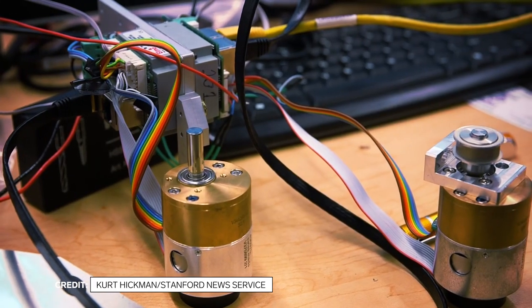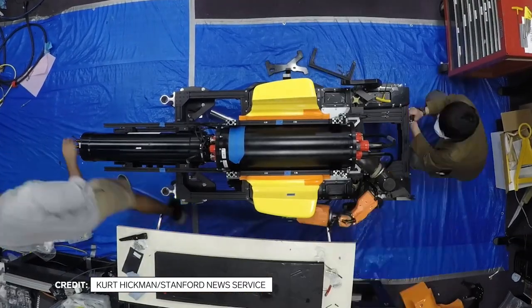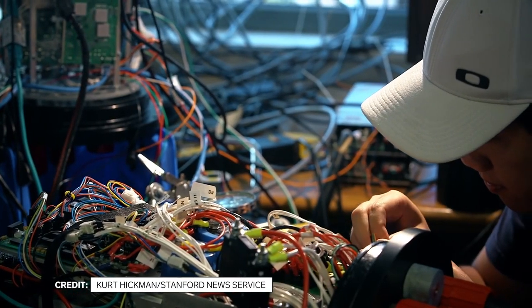A delay from September to February meant the ROV sat idle for months — Ocean 1K didn't like it at all. One arm was complaining, and to fix the connector you had to disassemble the whole robot because it's inside the shoulder. Underwater design hides a lot of things inside cylinders through connectors — it's very dense inside and covered from outside. These are prototypes of the future robot, and in the future the actual robot that will be deployed will have better integration and placement of components to make the system easy to service.